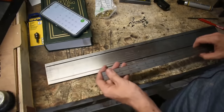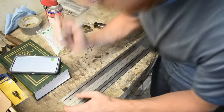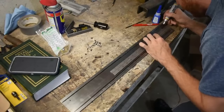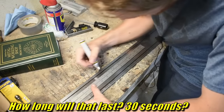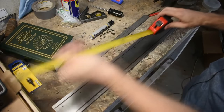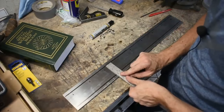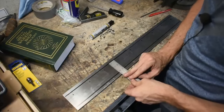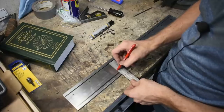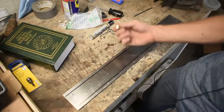And I know what you're thinking - Paul, you've never been one for any sort of precision before. Well, it's a lathe - it's supposed to be precise. Also, I'm going to try from this point on to be a little less crap in the stuff that I make. So 2.75 inches spacing. The plate is about two inches wide side to side. We want to put our bolts about 3/8 of an inch in from the side - that makes sense, right? That gives enough room, and then the end will go through and it will work. Is this actually brass? Yes, it's actually brass. Nice.